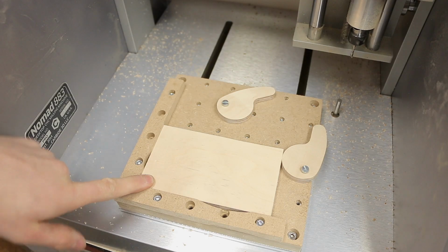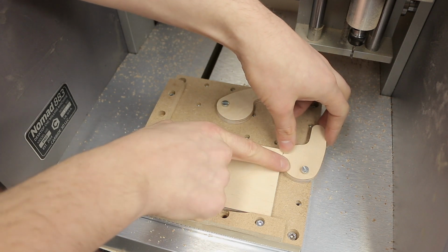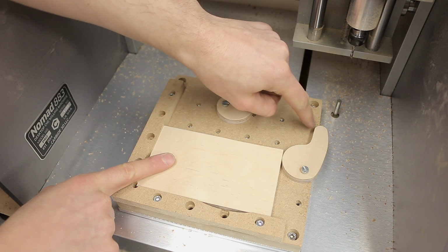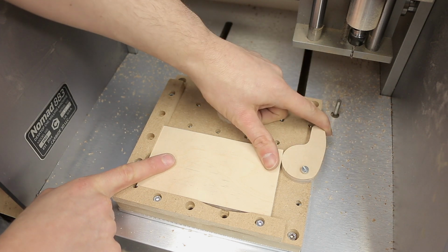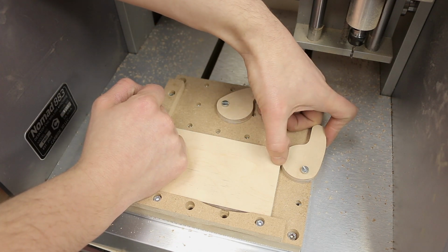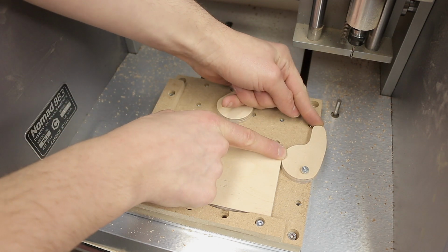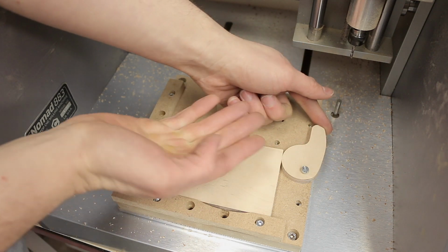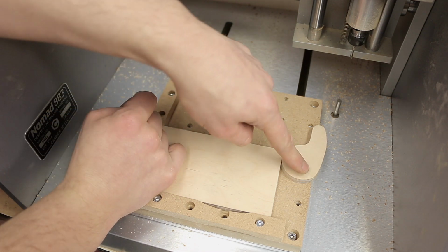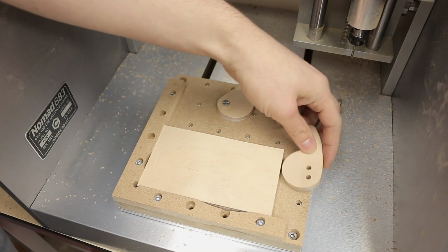Let me show you. So when I turn this way, this should clamp. And it should hold itself in this position. And right now, I have to do very little for it to go back. The reason that happens is because the force should be between here and here. If the force is here, which it is now, it just wants to open. So I should change things up a bit. I think if I just place this hole right over here, I'm already fine. Edit the hole.